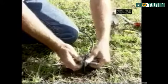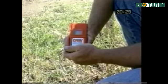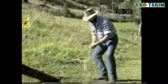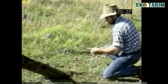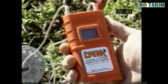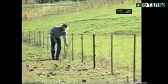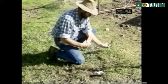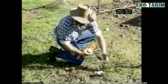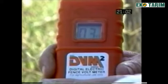When it comes to effective operation of your fencing, a Gallagher voltmeter is essential for testing fence voltage. The digital voltmeter can be used two ways: firstly, it enables you to check the voltage at any point along the fence; secondly, it's used to measure the effectiveness of the earthing system. These steel stakes are used to short out the fence 100 meters or 320 feet or more from the energizer and the earth system. An earth peg driven into the ground a meter or three feet or more from the earth system should pick up no power or a reading below 300 volts. A high reading indicates that the earth system requires further improvement.